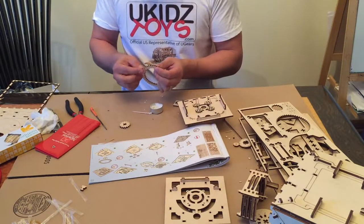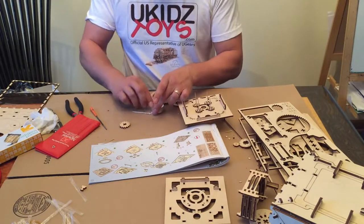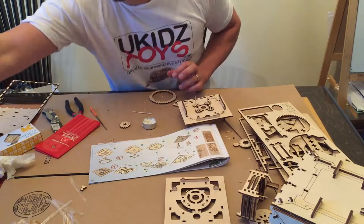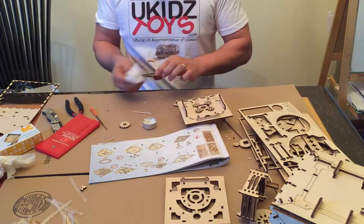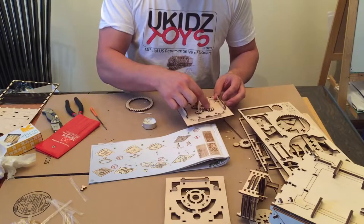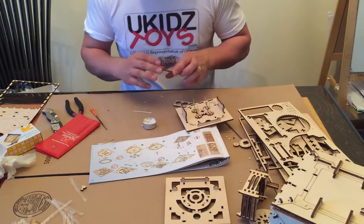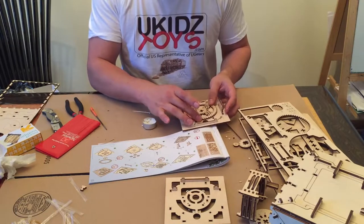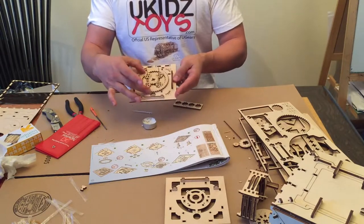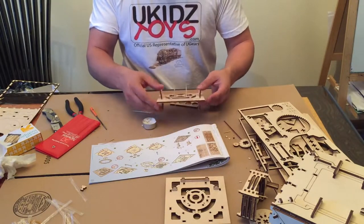When you put the wax onto your fingers, it's going to melt off a little bit, which makes it a little bit easier to put it onto the gear. Once again, clean it off your hands. Highly recommend it, because otherwise it'll transfer on pieces that you don't want it to be on. So that one gear goes in the middle. And then the large one with the numbers facing towards the top go right above all of them. So it's kind of like this. And then just check, make sure it's operational, that all of them are rotating. Although they're somewhat loose, they should still be rotating on their axis.